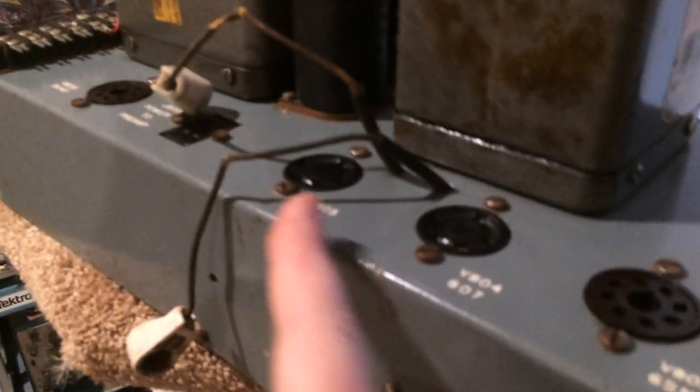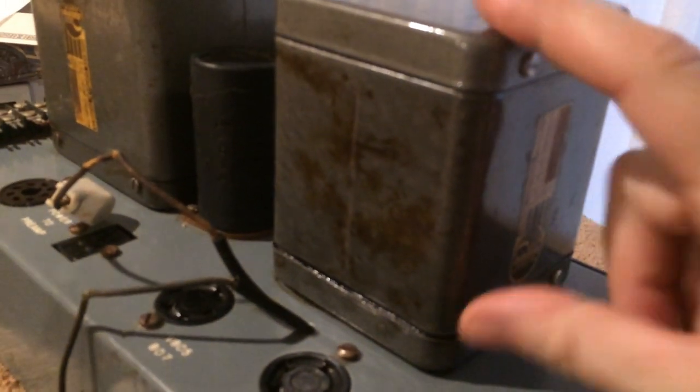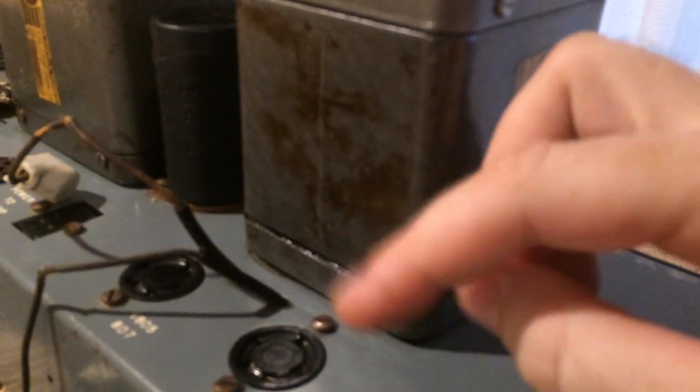These units were built like a tank because they had to be operational — the theater just running non-stop for hours every night. Here you can see there was some tar coming out from the output transformer; that's because the unit was abused. Probably one or both of the power tube biases ran away — the tubes were drawing much more current than they should — and that strained the transformer because there was bigger current running through it, more heat being produced, and then that heat just started to make the tar ooze out from the output transformer.